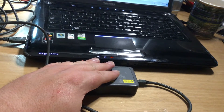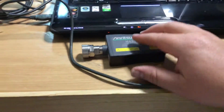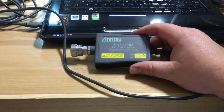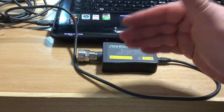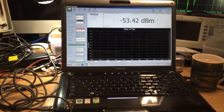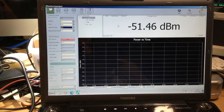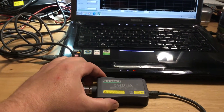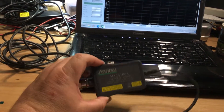The Sitemaster can also measure duplexer filters, bandpass filter characteristics, antenna reflection analysis, and RF levels at low level, similar to this sensor. This is like a low-powered RF sensor — you can use external attenuators to measure higher powers. This works from software, which is what we've got running, downloaded from Anritsu.